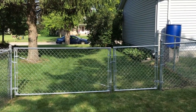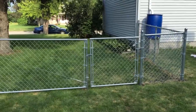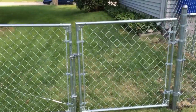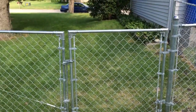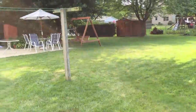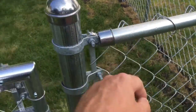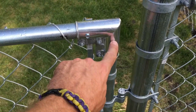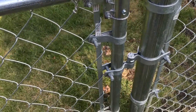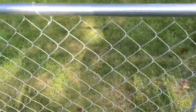For all intents and purposes the fence is done. I put away the camera after a while when I just wanted to get it done, so I'll show you how I put these gates together. This one is an 8-foot gate and a 4-foot gate to make a 12-foot section that opens up for vehicles. Basically it's just this top rail pipe — I bought these aluminum corner pieces, cut and measured them, dropped in your tensioner bars just like you would on a regular fence, put your hinges on, and you're good to go.